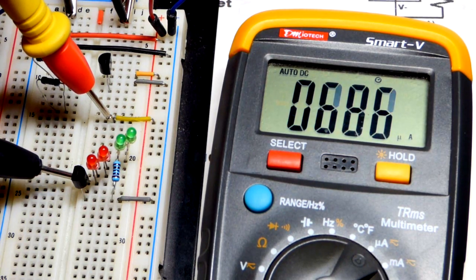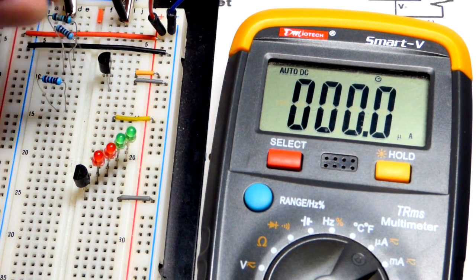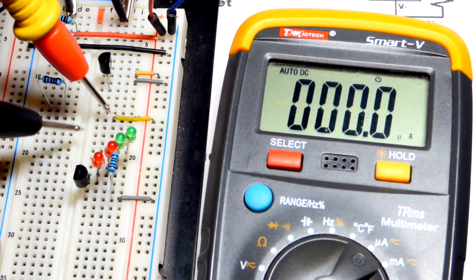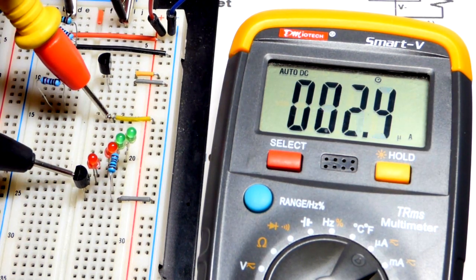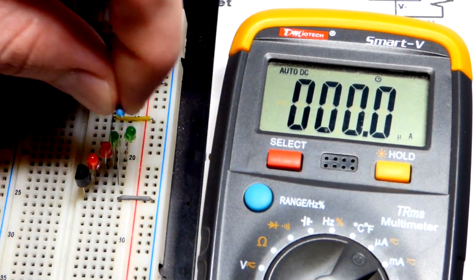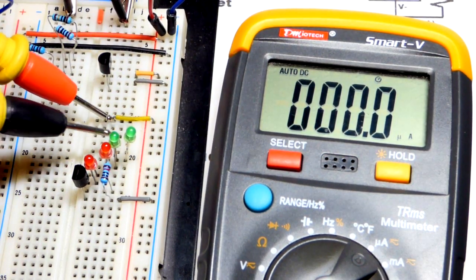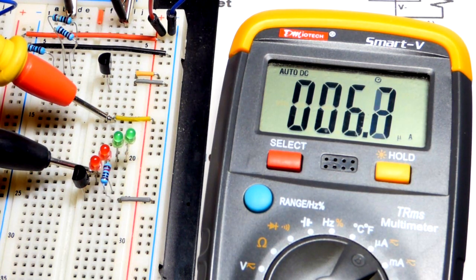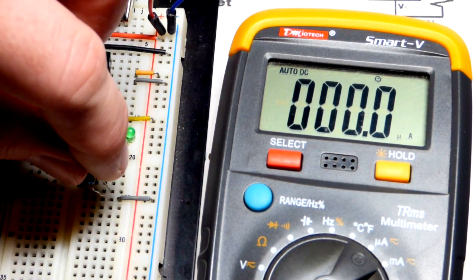With 100 ohms confirmed, let's try 1,000 ohms. We should have about 68 microamps of current, and it's pretty close — it varies a little but holds pretty true. I also have a 10-kilohm resistor. This is about the maximum resistance because this component is only rated down to 1 microamp, and you can see we're really close to 1 microamp with 10k ohms.